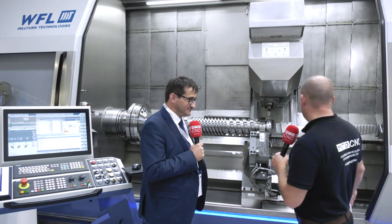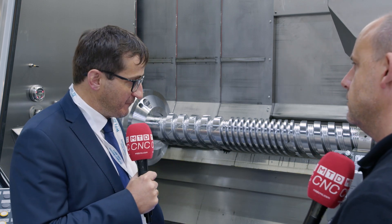How do they last so long Stefan? When you think they're doing demanding machining on harder materials, how do they maintain tolerance for so many years? WFL is for sure well known for the long-term accuracy of our machines. We build the machines exclusively from cast iron — we have no thin sheet metal on the back of a machine, we have massive sheet metal covers like here on the bottom slides.